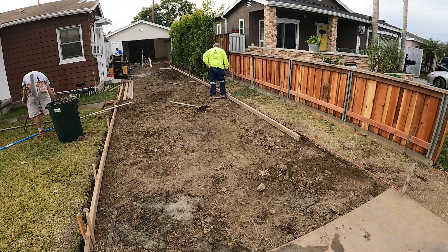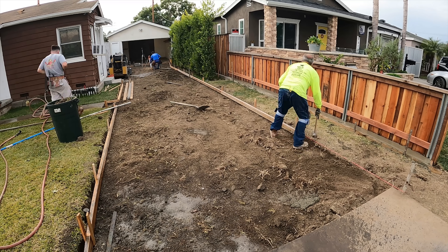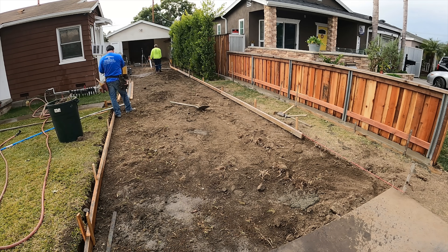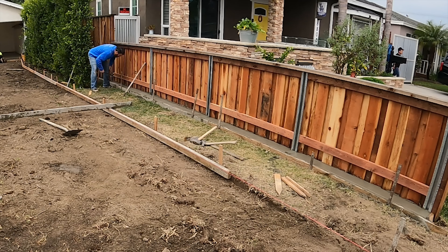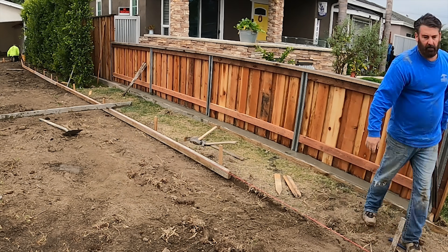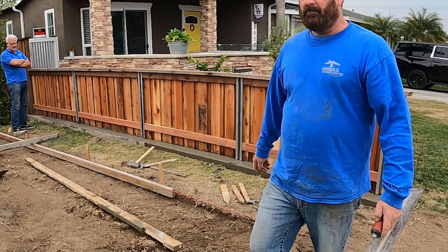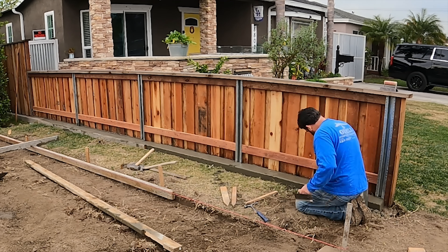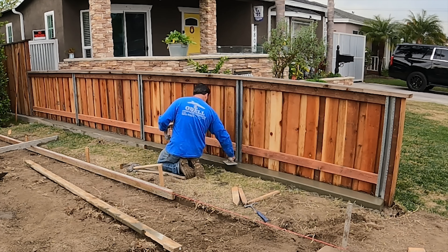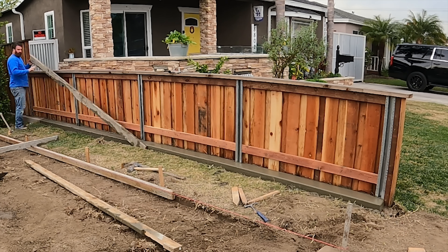The concrete in the garage from part one is drying right now — already placed, sitting while we set up the driveway. There's Carlos who helped finish; you can see that in part one. Now we're getting ready to strip this little curb. I had one percent accelerator in that curb and the garage floor, so it went off really nicely.